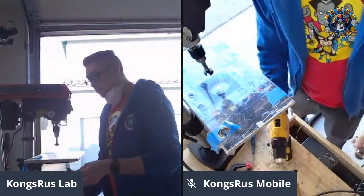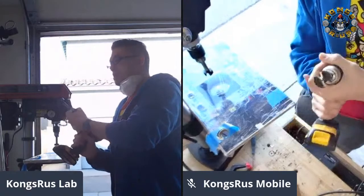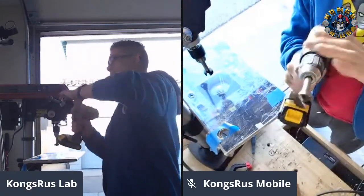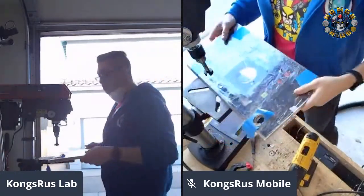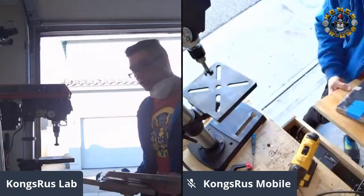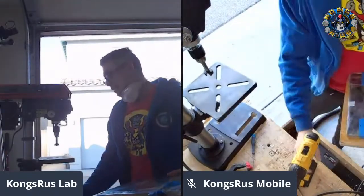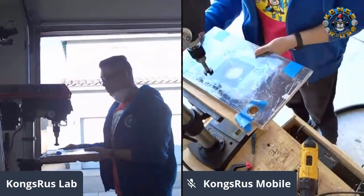So this is the same size as the hole saw, the 1 1/8 inch. All right, so this is now in, and I'm going to drill one more hole into the same board using the Forstner bit, and you'll see the difference of how I can just go through the board really easily instead of having to flip-flop them around. So let me get this board on right here.